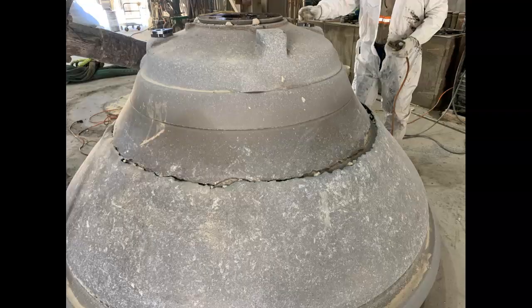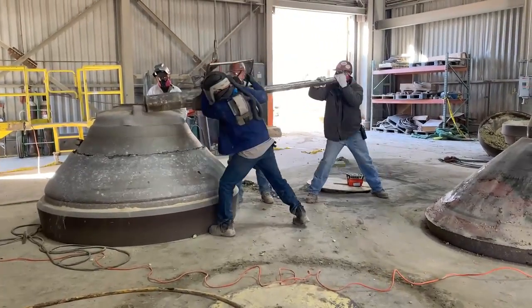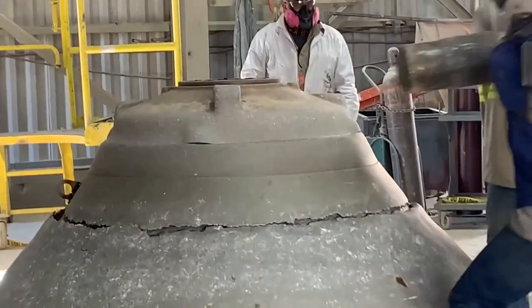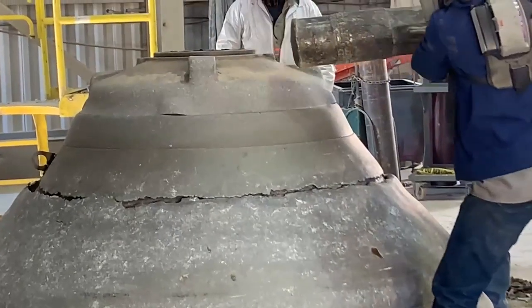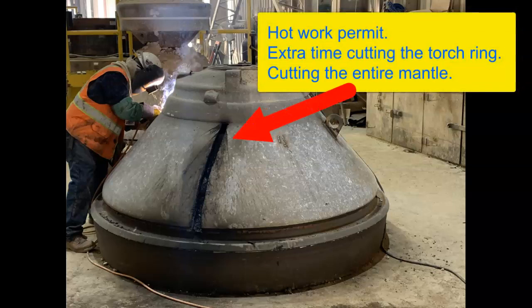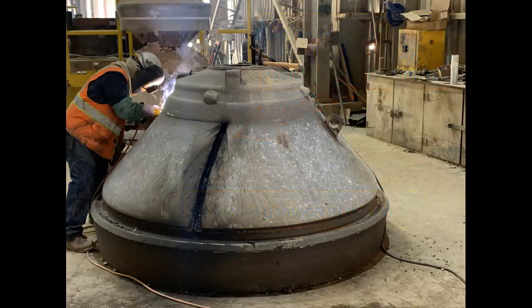This mantle is completely worn and is ready to be replaced. Despite this crusher's importance, the process of replacing the mantle seems to come from caveman days, with some locations still using battering rams to loosen the head nuts. This is very unsafe and very inefficient. If the battering ram doesn't work, they will spend many hours cutting through the torch ring or even through the entire mantle trying to get the nut loose, requiring the use of hot work permits and other safety mitigation measures.